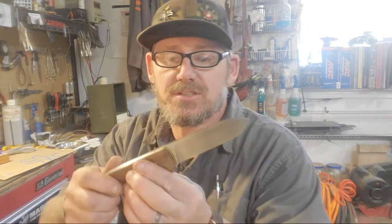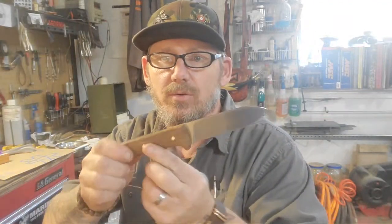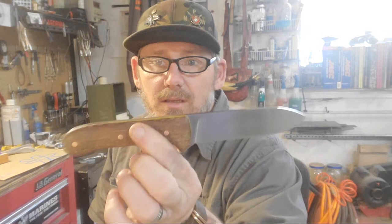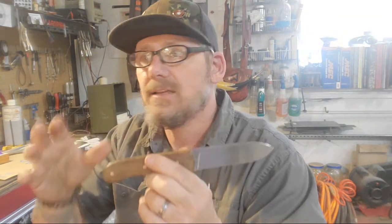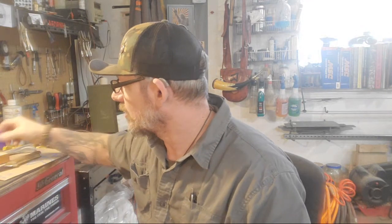We're going to build stencils. I'm going to show you my homemade light box and how I do it. I know this video is coming in choppy — I'm not sure why, probably the weather since it's snowing again. The knife's coming along well — we're almost done with it. I have cold or hot stamps to stamp my logo on carbon steels when I'm heating them up, but I don't have any way to stamp cold on stainless steel. I can't throw stainless in the forge — it'll decarb like crazy — so I have to etch my logo when I do stainless knives.